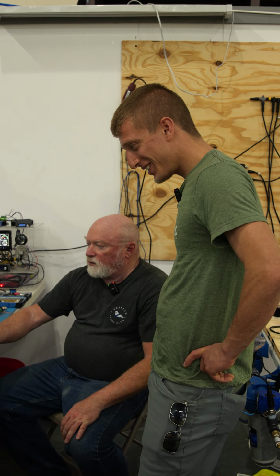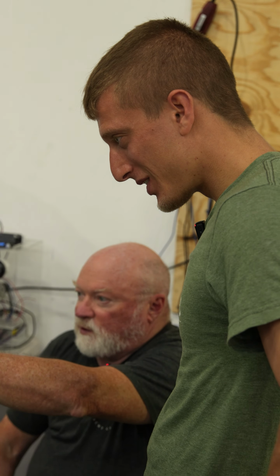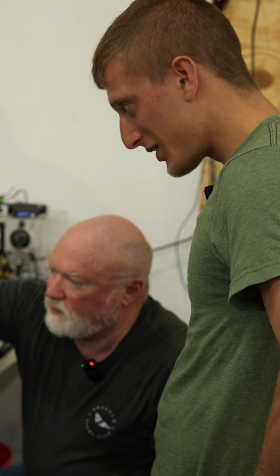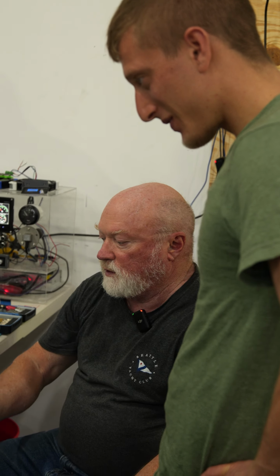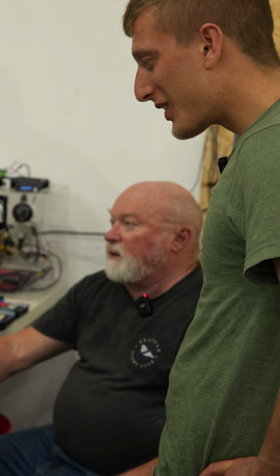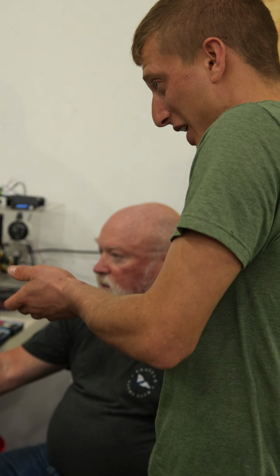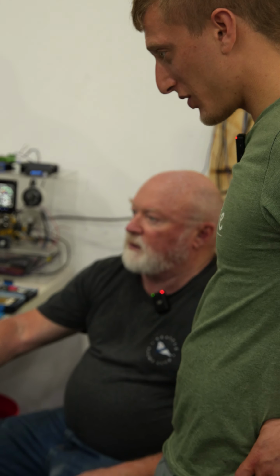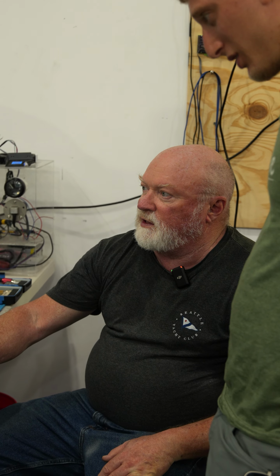And then it graphs all this stuff too in charting. So you can see all your boost pressure, compressor, flush pressure, how much water was made and flush water used, the controller environment, temperature and humidity, and then up to 4 auxiliary temperature sensors. So you can effectively track how many gallons have passed through your membranes in entirety, your filters, your sediment filters. You can reset the values for the sediment filters and whatnot. It takes care of all those functions for you.